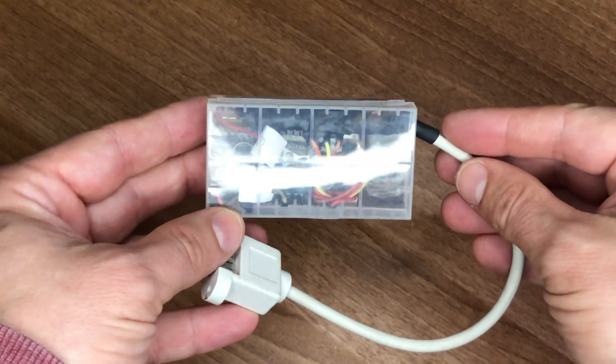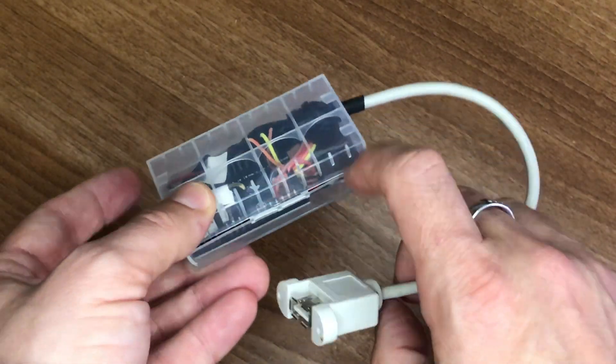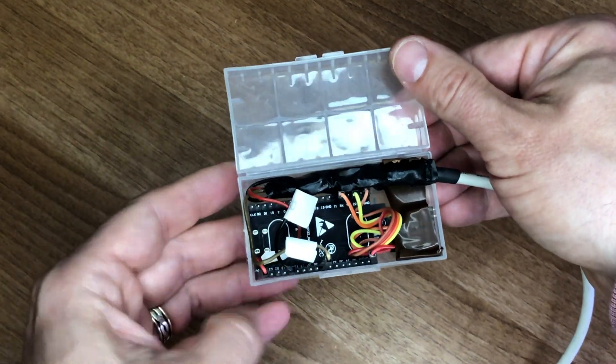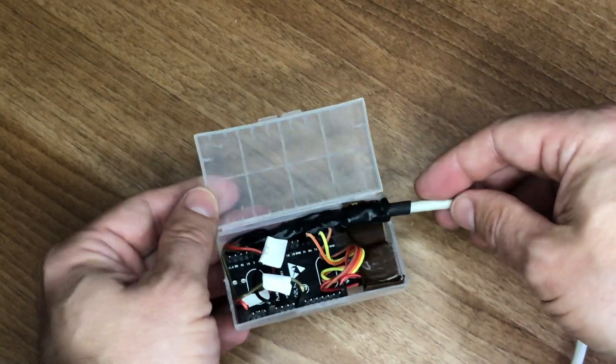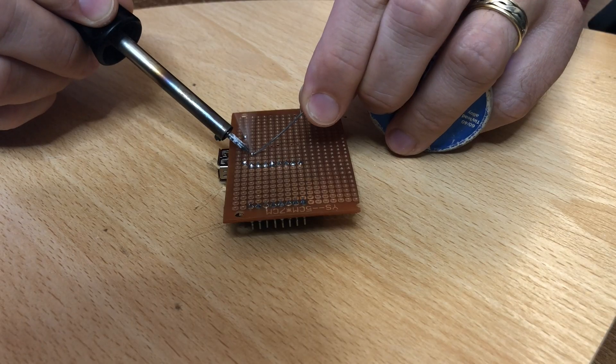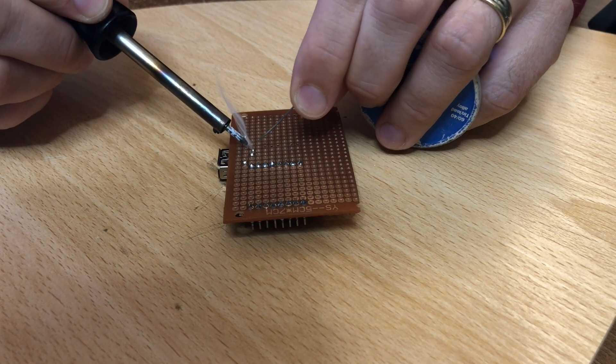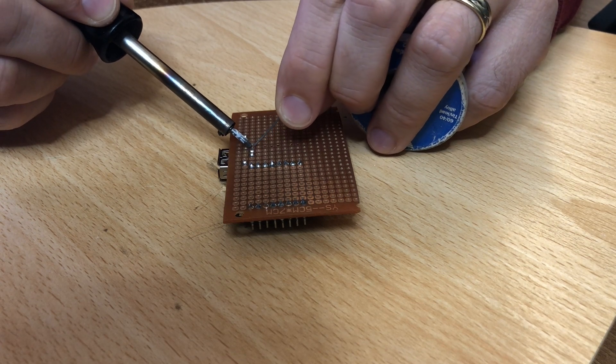So why am I creating a better version? Well let's start with the hardware. The original version was just bodged together and stuck inside an old battery case with a USB cable sticking out of it and the transistor protected by insulation tape. It really wasn't very pretty. I decided to stick all of the components on a breadboard, soldering them all in place. I chose a D1 Mini this time with an ESP8266 chipset instead of the ESP32 I used before.